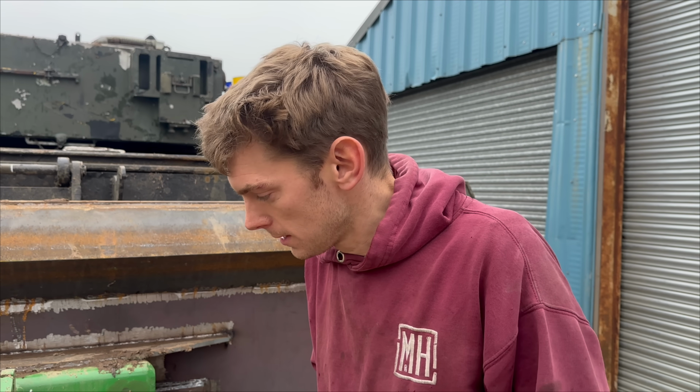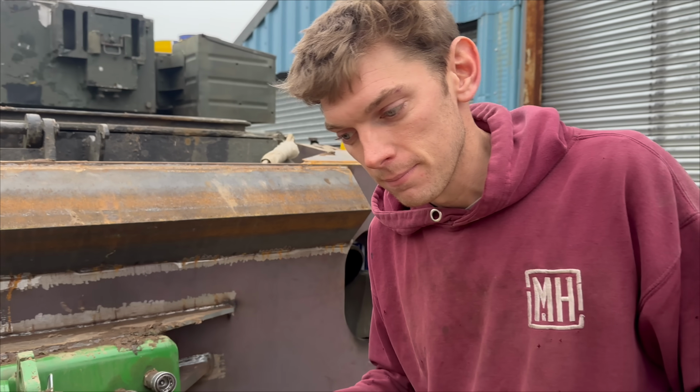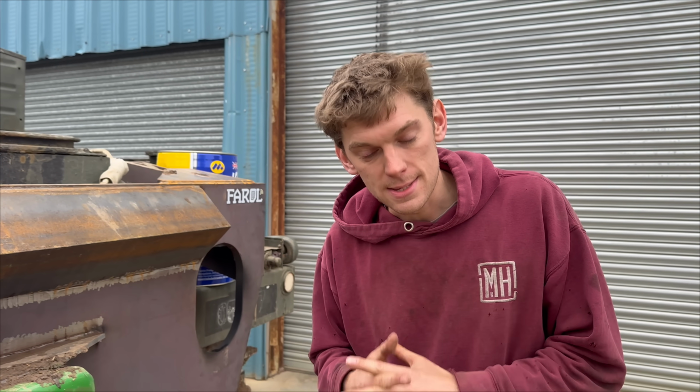So people that don't know, tanks don't automatically trip into charging. You have to sort of tell them to start charging the batteries. But they charge a lot harder than 24 volts. And the little brain on that tailpack system was very power sensitive, and what it didn't need was 36 volts. That blew the little brain up.